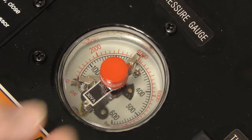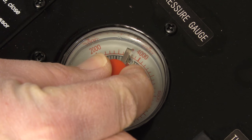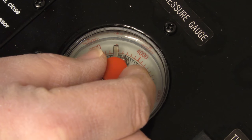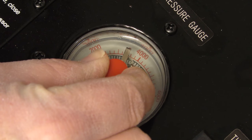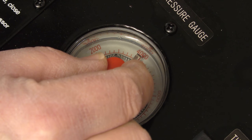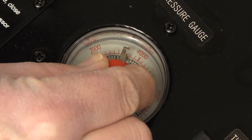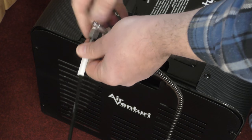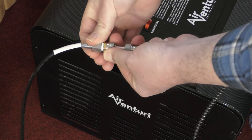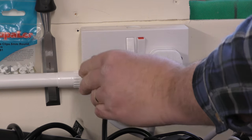The compressor has a red needle on the pressure dial. Set it to the pressure you require and the unit will auto shut off when it gets there. You do that by pushing the red button down to connect with the metal needle inside the dial and line them both up to confirm the pressure you require. I work in bar, but everyone talks to me in PSI — the dial does give both bar and PSI readings. The compressor connects directly to your foster adapter on your cylinder hose; the male to female connector comes with the compressor.